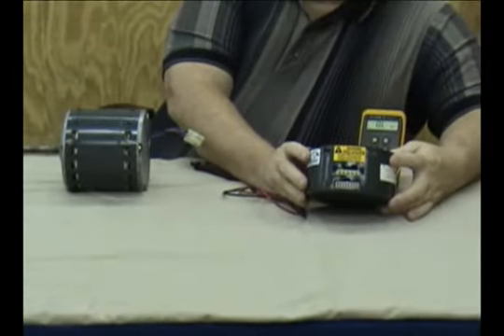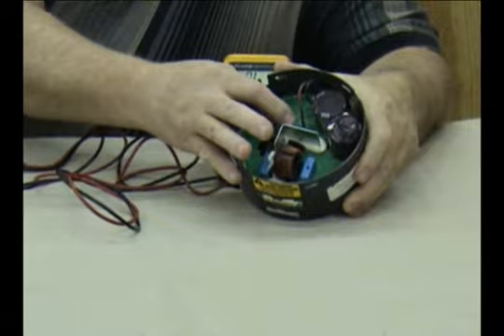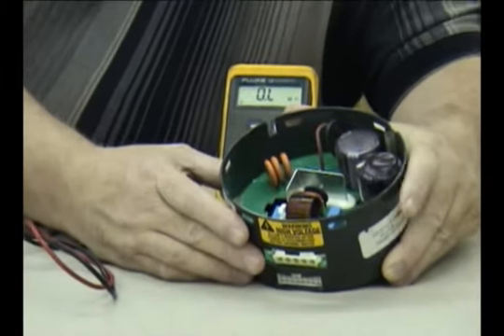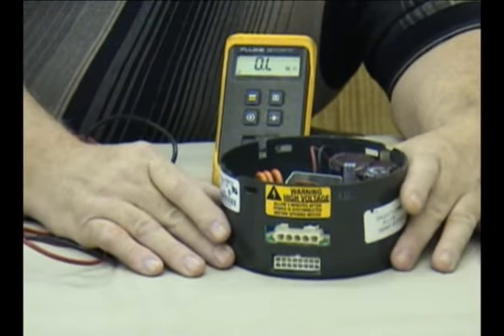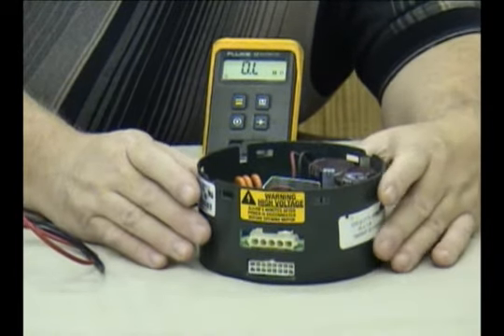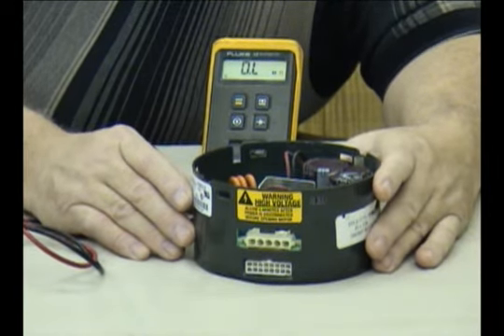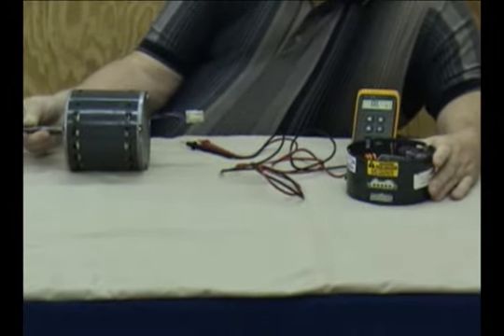Some theory about how they work: almost all of them have incoming AC power. That AC power gets rectified by a rectifier, smoothed by two to four capacitors, filtered by filter circuits, and then gets passed down to the power circuits below that usually have transistors, integrated circuits, and other chips which modulate that DC power. It starts out as AC, gets converted to a pretty close to pure DC, and then that DC is modulated — the frequency of it is modulated — to match the speed that the motor is supposed to turn at.